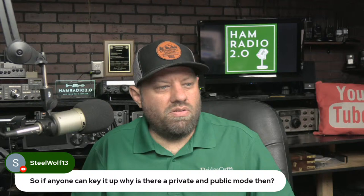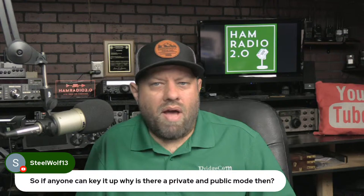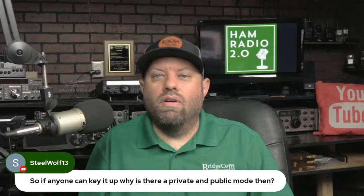Any other questions at all? If anyone can key up, why is there a private and public mode then? If you're talking about private and public talk groups, you can enter a private ID, which is a subscriber ID. My ID is private, your ID is private. You can enter a person's ID, which is called private, and talk directly to that person rather than talking to a talk group over the repeater. I don't know if that's what you're talking about. Clarify what your question is there.